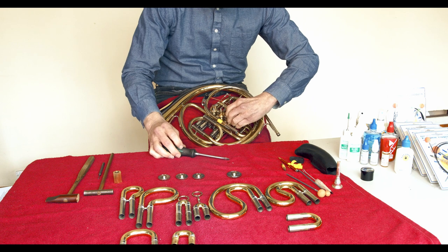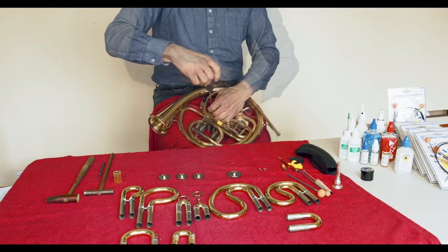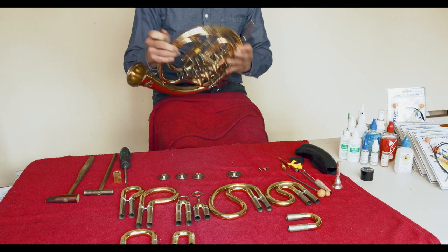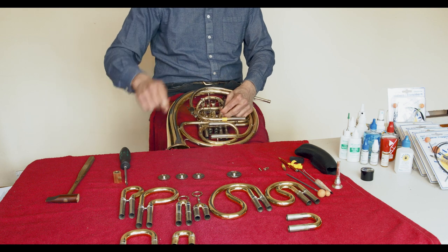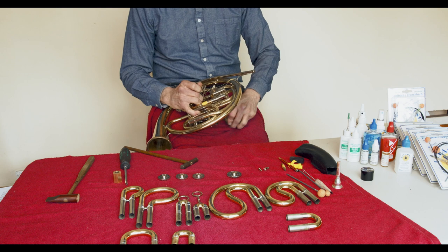Once the valves are clean and lubricated and reassembled, I would check the bearings to make sure there's not any excess play. A little end play is okay, but if you grab the rotor stop and try to push the shaft side to side, you should not feel any movement. This side play, not end play, is usually what causes noisy valves.